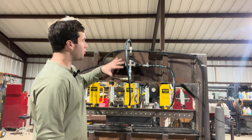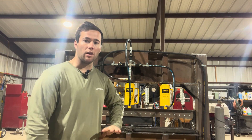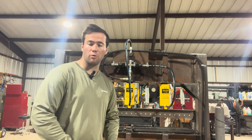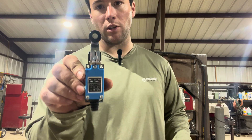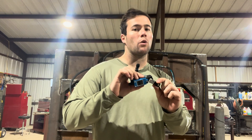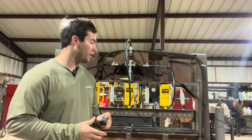As you can see, we have all the hydraulics plumbed back here with our regulator switches and our four-way. The pump was the only trouble — getting it primed was hard, but all you have to do is leave the cap off and cycle the pump for about 20 seconds to get all the air out, and after that everything works very well. Since this video is getting pretty long, I'm going to be making a separate video covering the limiting switch, which helps me make repeatable bends. If you'd like to see that, please subscribe and hopefully that video will be out in the next couple of weeks.